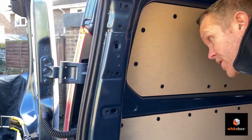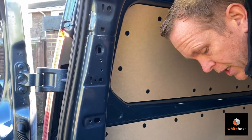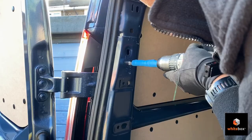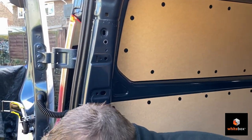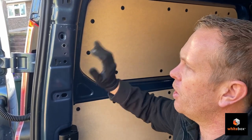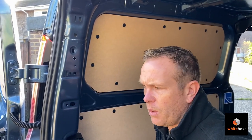There's our pilot hole. Just to let you know, I've checked in advance — there is a wiring loom here but it's pushed nicely back out of the way. You don't want to be drilling through any wiring. I've got the bigger 12mm drill now to open out that hole. This makes quite a lot of swarf, so you really need to clean it up carefully because bits of metal near the floor when it gets wet are going to rust. Now we've got a nice hole — if it were an external hole we'd treat it with rust cure, but this is an internal hole and it's still got paint on there, so I'm happy it won't need treating. Next, let's put the nutsert in.